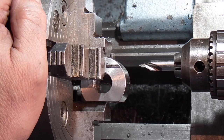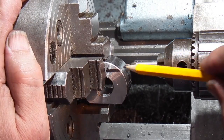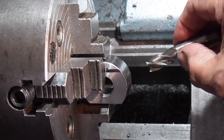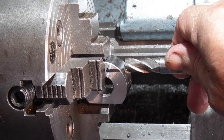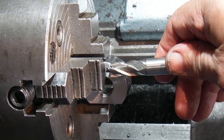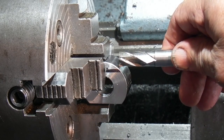Because I'm coming onto a curve, I can't really put a centre drill in there — all it's going to do is push it off and snap the end. So what I'm going to do is use an end mill to put a flat on there, and once I've got the flat on I can drill the hole. In fact I might use the end mill to go in quite a way to give me a nice surface.